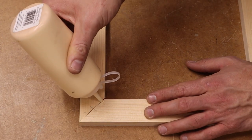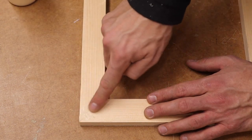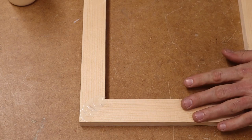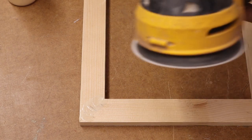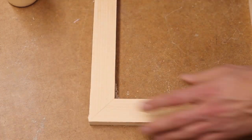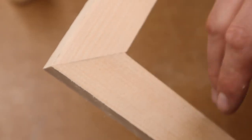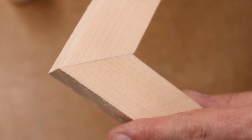Take your glue, squeeze it in there, then get your finger and rub it into the joint. While the glue is still wet, take your orbital sander and sand it — I like to use 80 grit for this, it seems to always work well. Essentially, the wood glue and the sawdust combined with the sanding makes its own wood filler, fills it in nice and smooth. Once that dries it'll be ready for paint.